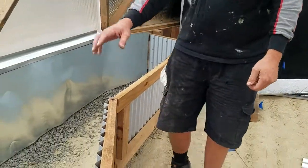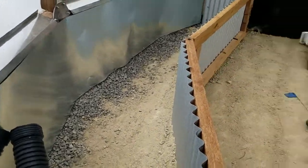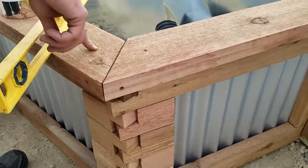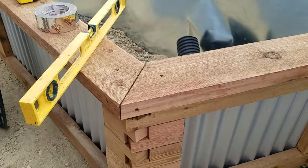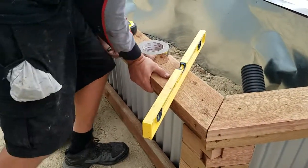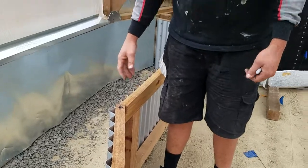Other than that, once the corrugated steel wall is in place, we put a top rail on it — a two-by-six cedar piece screwed down into the top rail of the wall. These are just mitered cuts that bisect each corner, so you have to measure those depending on your layout. That gives you a pretty rigid surface to sit on. These are all very, very strong — there's a tiny bit of flex, but with the top rail on it it's even more rigid. That's a quick overview of what we did to build these garden beds — hopefully it's of help!